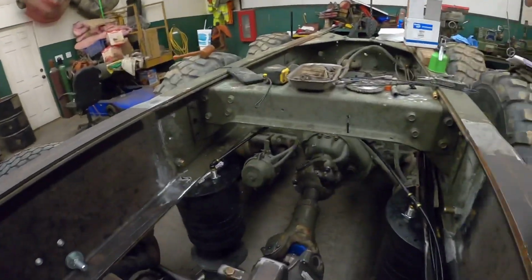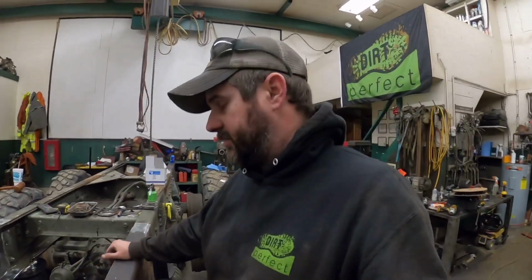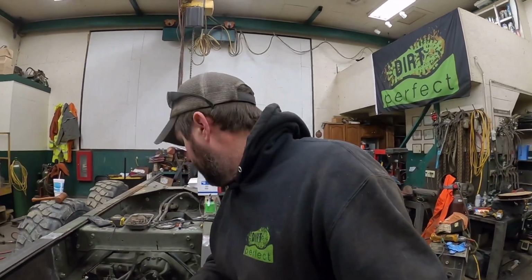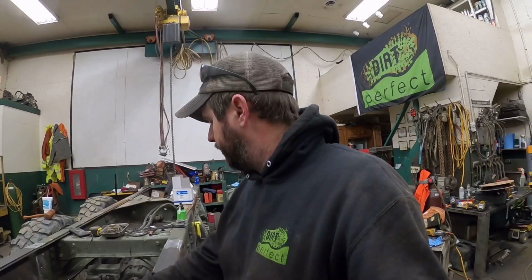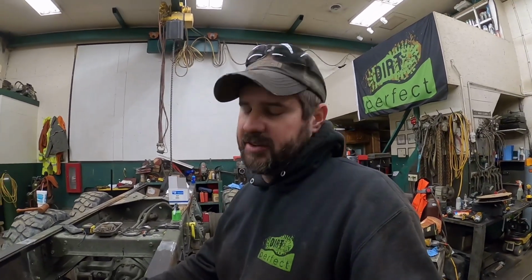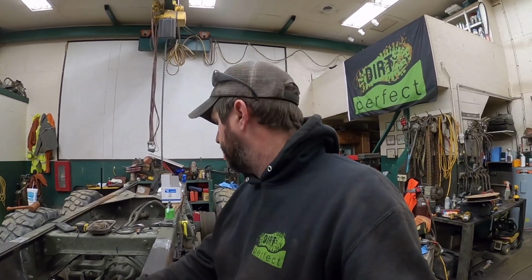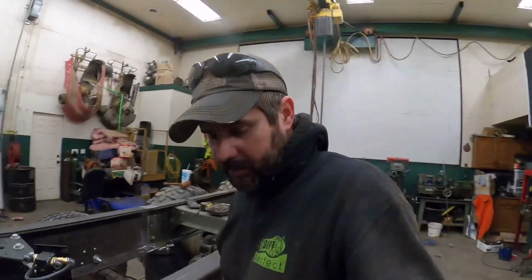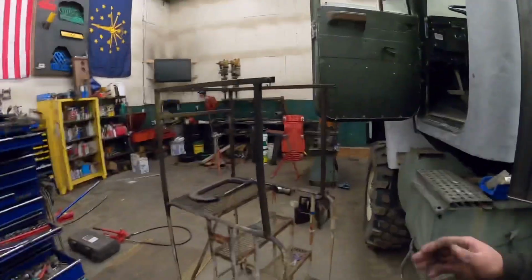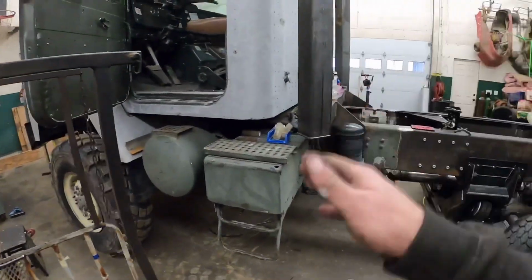So I kind of steer away from them a little bit in braking applications or anything of major importance. Now on these airbags and stuff like this, they're the cat's meow. They're awesome. They work great. They're quick, easy. You can get them undone if you need to. Love them. But I don't know. After the first time I thought it was a fluke, the second time I thought, nah, that's more than a fluke. So if I have one fail now, I go back to compression fitting on brakes. But anyways, with all that being said, let's hop up in the cab.